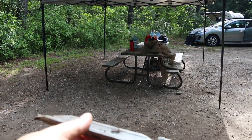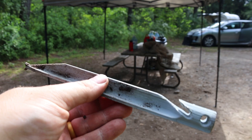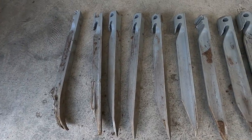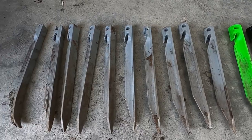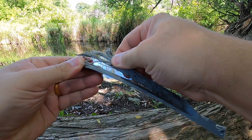During the teardown, that's when the second problem popped up. Remember that layer of gravel? It chewed the hell out of several pegs that were unlucky enough to not have been able to just push the gravel aside as they were put in the ground. Some were worse than others, from just a split tip all the way to half of the peg being completely mangled. It was an excellent opportunity to see the primary weakness of 3D printed tent pegs: layer adhesion.